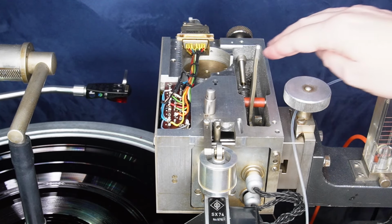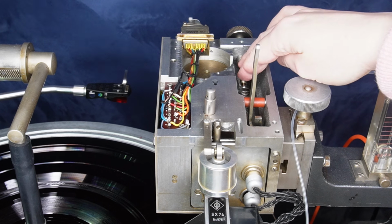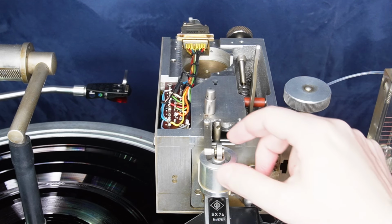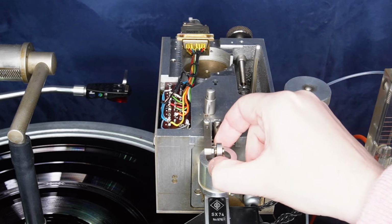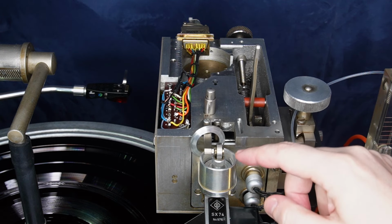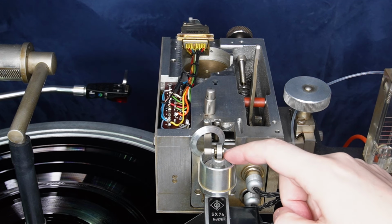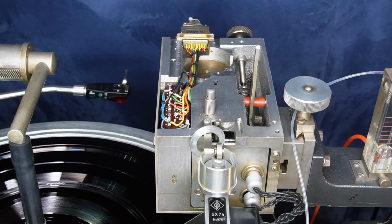We're talking about this spring inside the suspension box that regulates the cutting depth. Anyone who's ever worked on cars will know that suspensions usually need some kind of damper to smooth out bumps and vibrations. And our lathe has one too. This oil-filled container is called a dash pot, and we can adjust the reaction using a small knob on the piston here. Once the tension screw and dash pot are set up just right, you can happily cut a nice consistent groove even in a fairly lumpy disc.